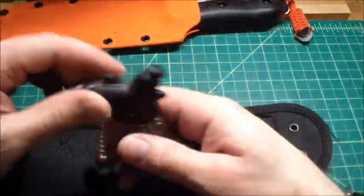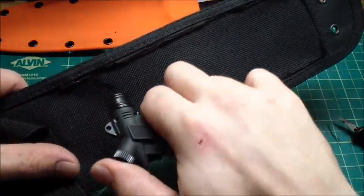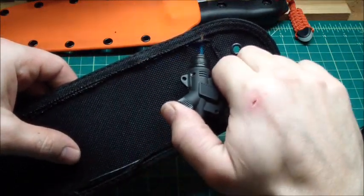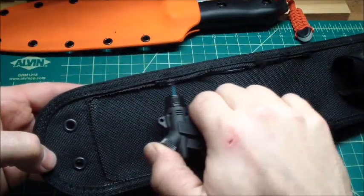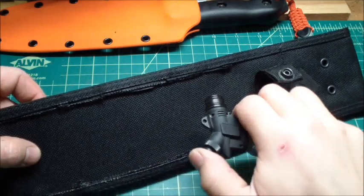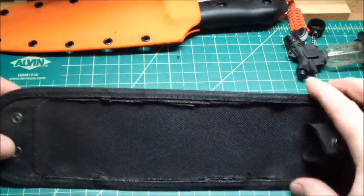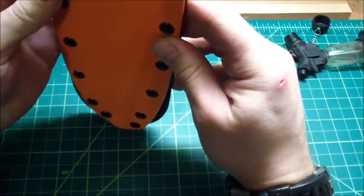The next step is I'm gonna take a lighter and I'm just gonna, you know, like when you do the paracords, I'm gonna burn all this cut portion so they're enclosed, so they don't just keep ripping and fraying. Kind of closes it, creates a layer of plastic. Yep, that's all. And now I have the nice backing ready to be mounted like this, you see.